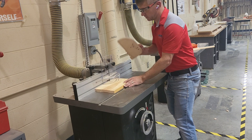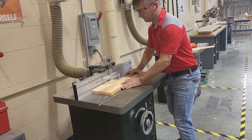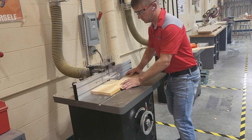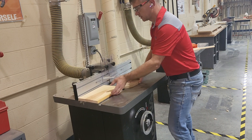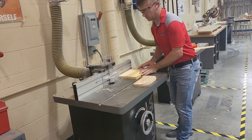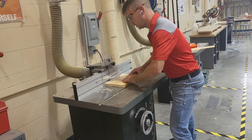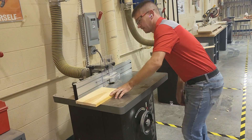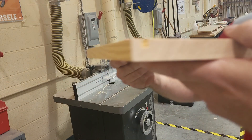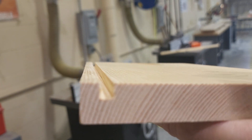I'm going to get my push stick right here so I can push it behind. You know where the router bit is — I don't want this to hit the router or the bit. Keep pressure in and pressure down. Let's go ahead and run it again to get this groove clean. There we go — let's take a look at the groove. Yep, there it is. We just put a groove all the way down that thing.